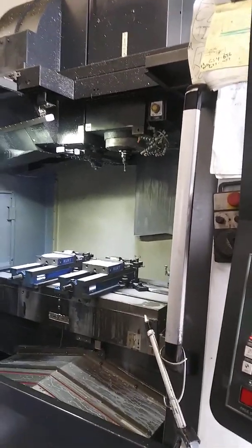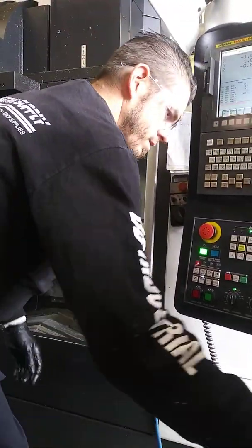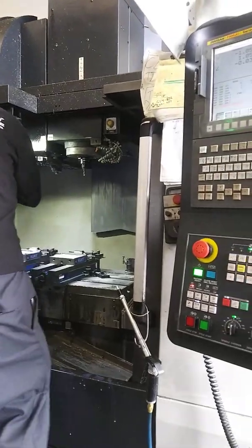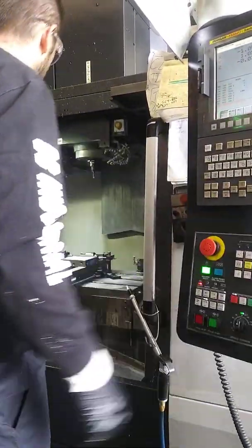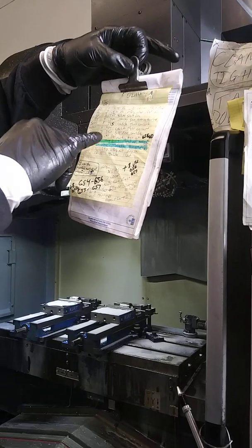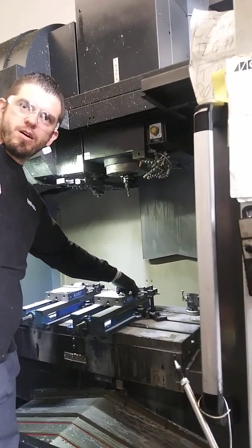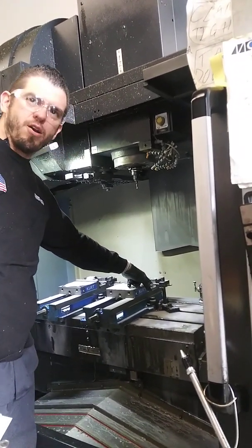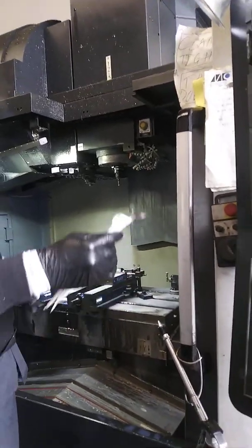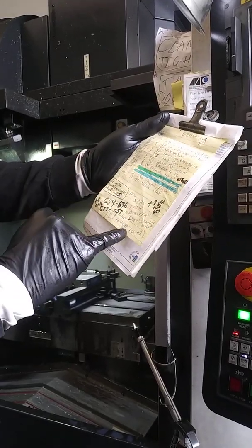There's our inch of thread mill - well, this is the thread mill. It grabs it. Again, if not, we have another one for the M10 over there already. Now, to the thread mill, I gotta read my notes. See 1, 2, 3, 4, 5, 6, 7, 8, 11, and 12 are all touchdowns. First off, up centerline. Centerline means you have to be here - the tools have to be in the center of the part. I'll show you how to get that later, after this part's done. But right now, I'm gonna show you how to touch off thread mills.